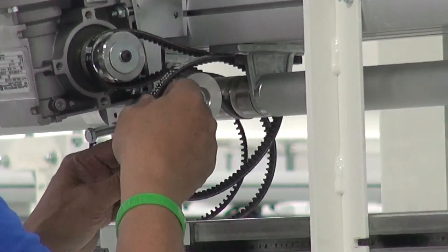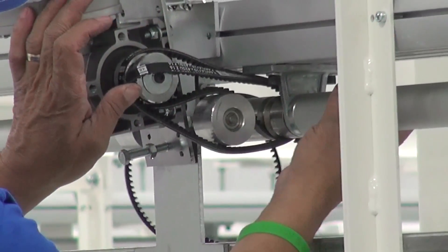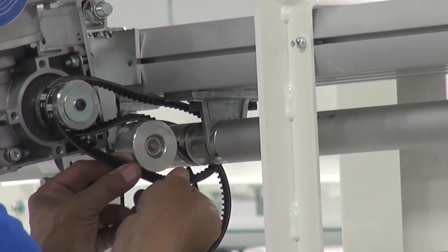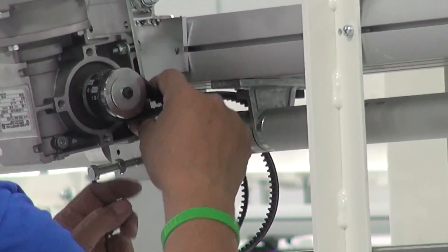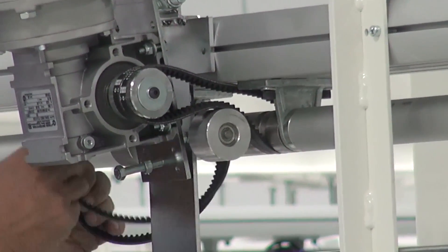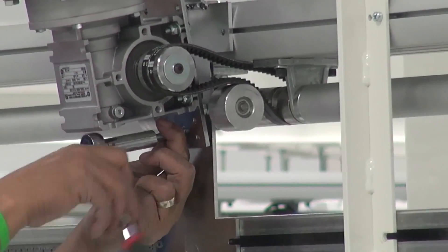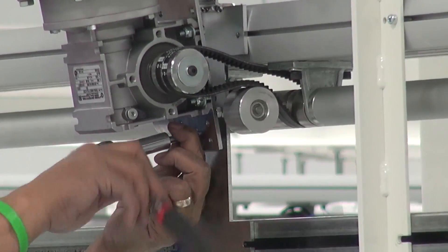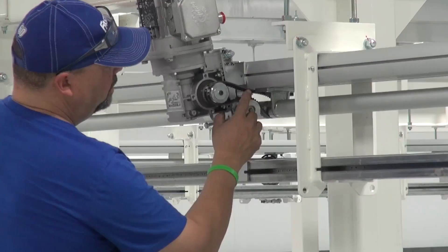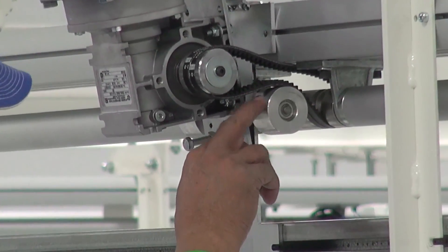Do the exact same thing for your second belt. I find it's easier to twist the drive tube to get the belt to slide over the pulley — do a half twist and get it over the idler. The belts are installed on this side, then do the same thing on the opposite side. Now you have all four belts installed, and you can do a visual lineup to make sure the belt spacing is the same on both sides. The belts should be somewhat centered on the idler pulley.